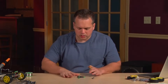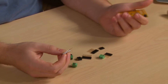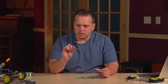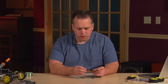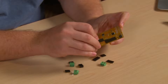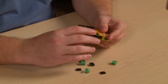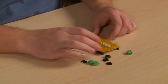Let's start soldering. We're going to take all of these electrical components — basically the connectors that go through the board — and start by soldering all of those. These connectors here are the through-hole stackable headers for the Arduino. We'll start by sticking all of these components through the holes of the Arduino shield, like this.